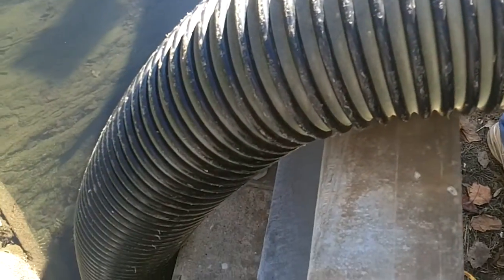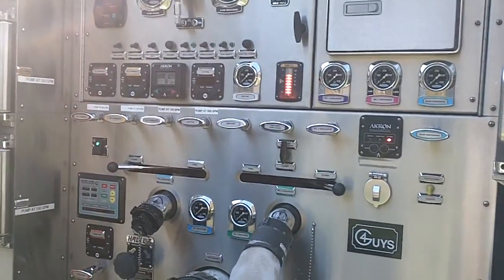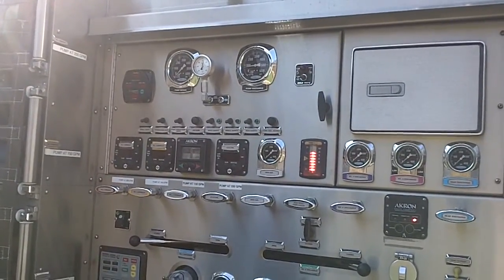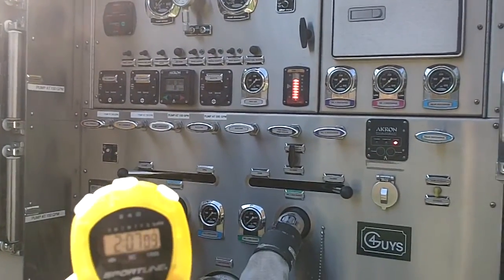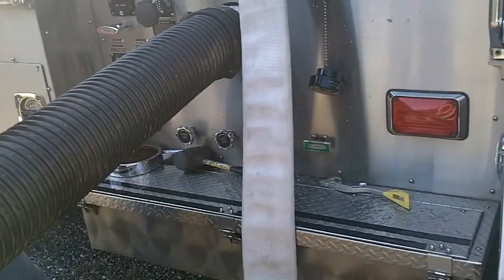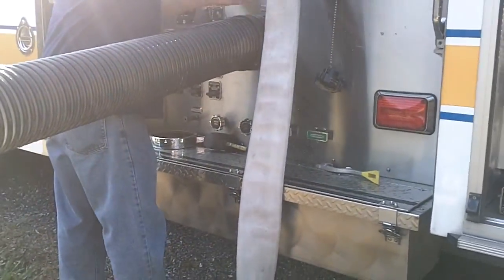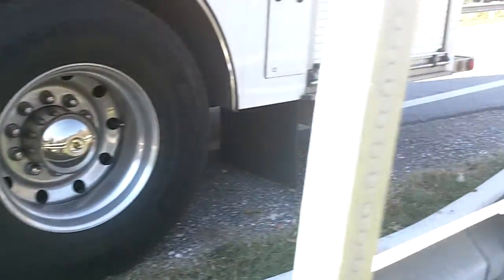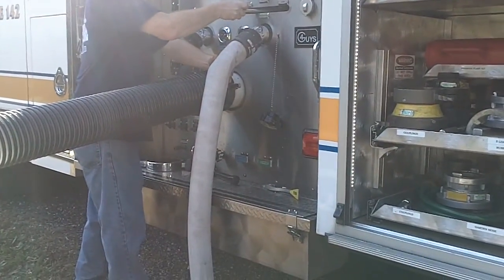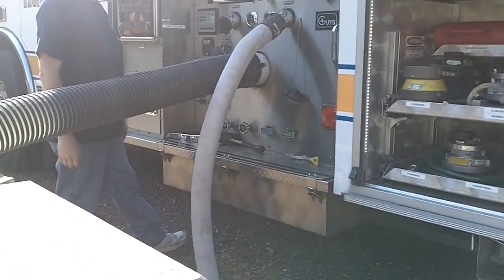You can see we still have some air bubbles coming through. And here we go — changing the motor a little bit. Now that pump is primed. Two minutes, six seconds for 16 feet of lift. We'll have him go ahead and charge the discharge — charge that three-inch line just so we have some water flowing. You should hear the air primer kick in. There it is. Now it's good to go. It kicked in and took an air bubble out.